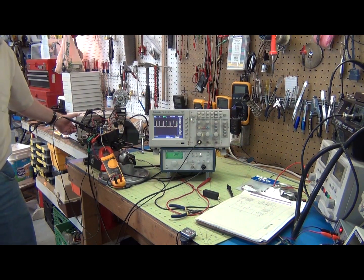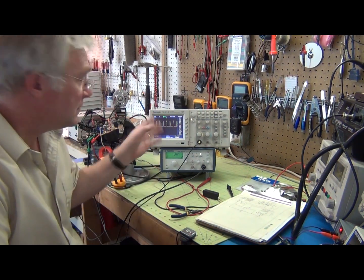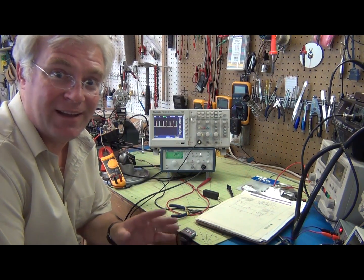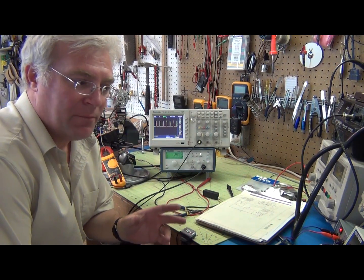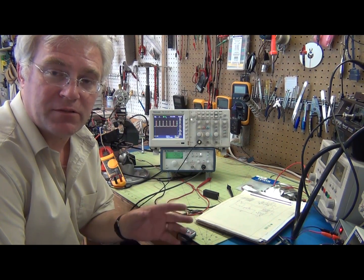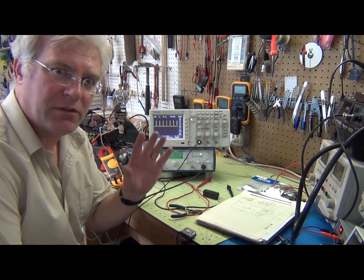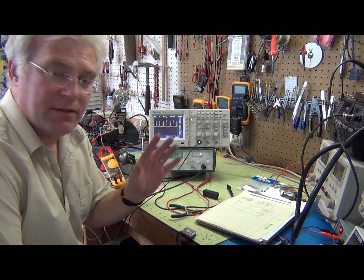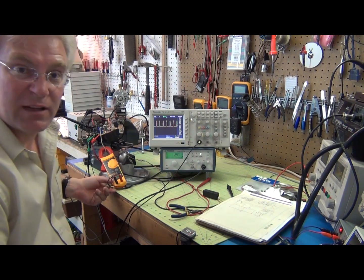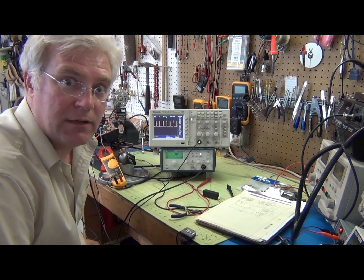Well, that's interesting — it comes on but doesn't stay on. The signal is obviously injecting and turning those power transistors on because the motor does turn up, but it sounds bad — kind of grindy inside. It is turning on, which proved positive that the signal can get to those power transistors. But I couldn't understand why it turns maybe four or five times and then stops, and then when I turn it off it turns again. I've got my amp meter hooked up in line and I'm not really seeing any amps flow — it's not like it's overheating.